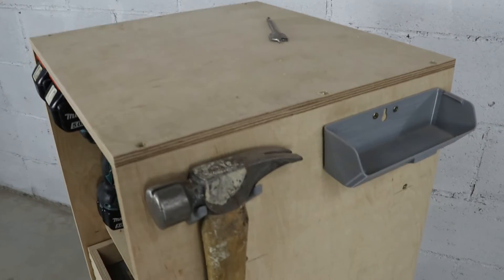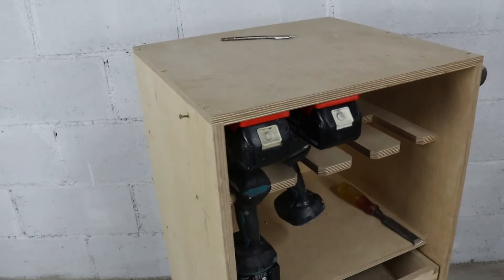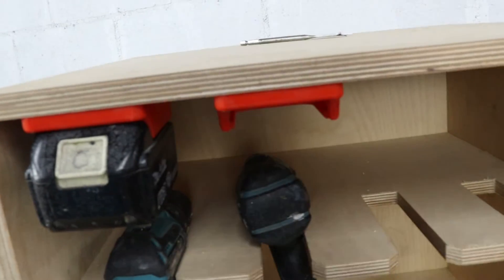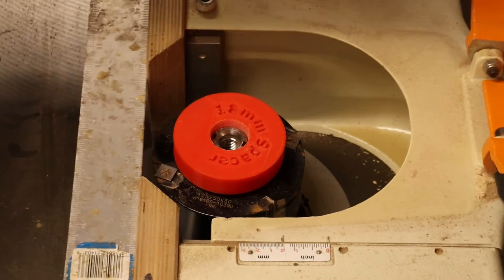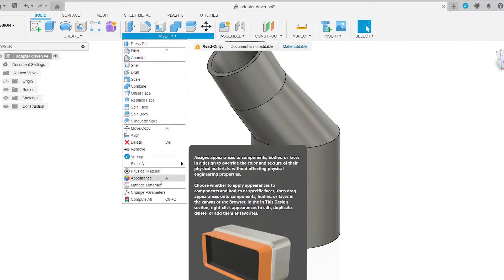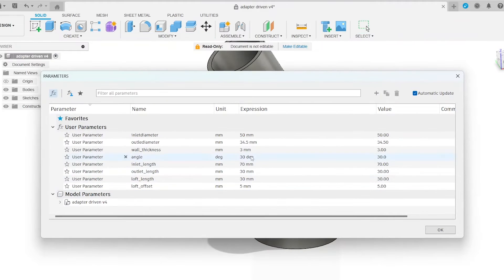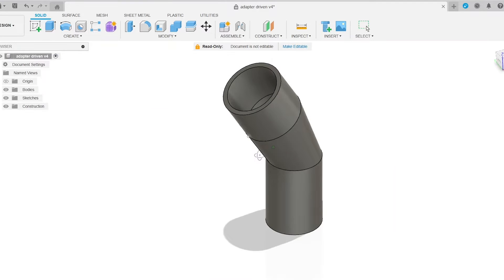The other main thing I use it for is generally just odds and sods around the workshop — hammer holders, little tubs, battery holders, setting up tools. That's actually really useful, there's just tons of this stuff. Vacuum hose attachments — that's a really good one. It can be such a pain getting attachments to work with the right diameters, they're all slightly different. So I'm in this parametric file and all I have to do is type in the dimensions of the hose, and just like that a specific adapter is ready to print.